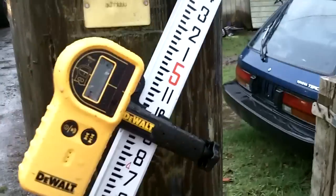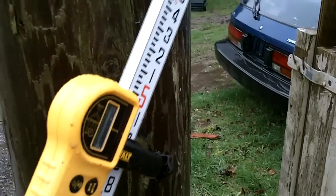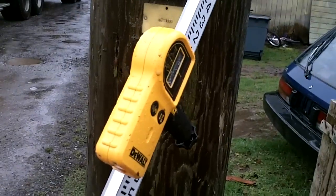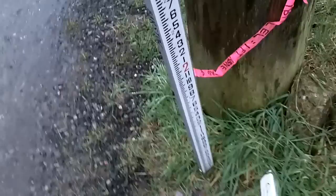We've made our revisions here — we've added 30 inches onto our benchmark height. So now you can see we need to go down quite low to have the laser level shoot off here. That bottom there, when it beeps, that's our right elevation — that's the bottom of our sand. So we can add 12 inches of sand on top of that bottom. Let's go show you how that looks.